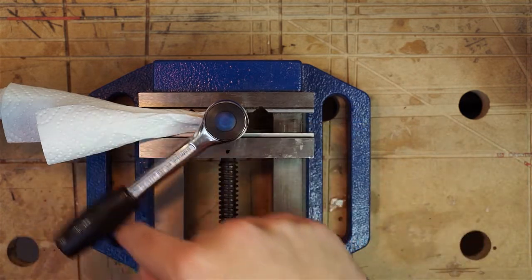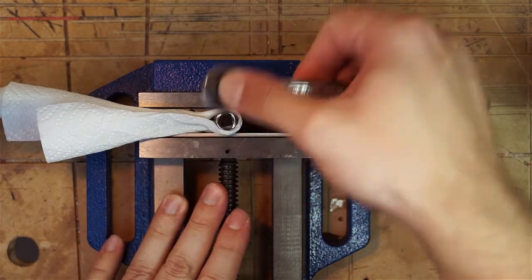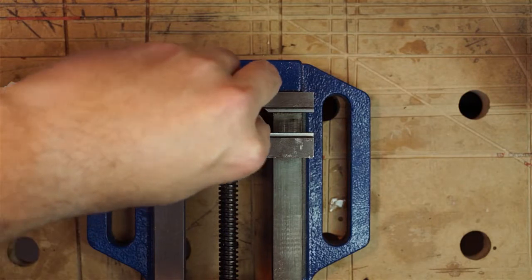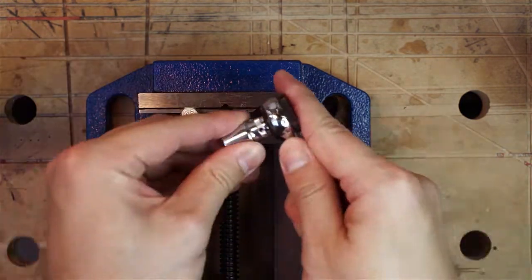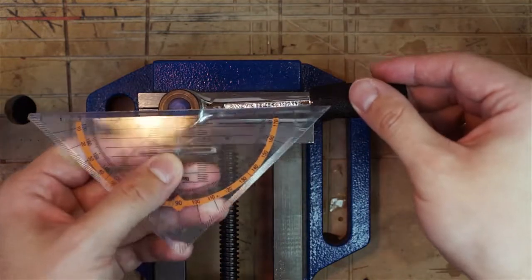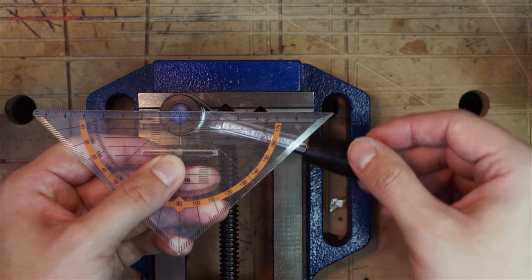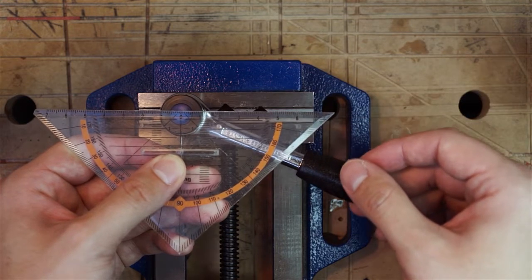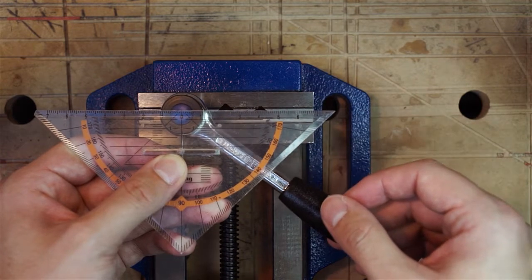And if your construction depends on low tool angles for mounting, you should clearly alter your design and rethink it. But hey, let's repeat this test for kicks with a real screw in the vise. As you can see, you need around 10 degrees of movement to be able to turn the screw with about 6 to 7 degrees of play between clicks. To me, this is tight enough.